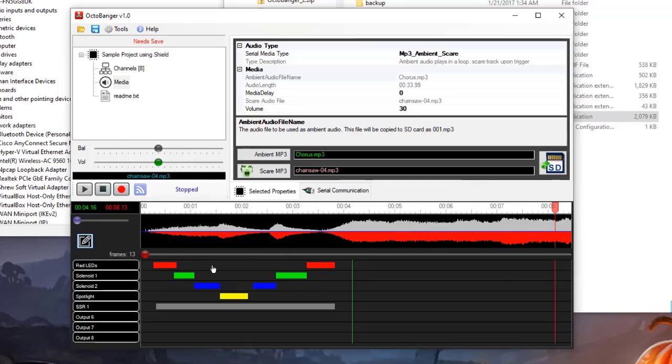And if I use the left button and drag it, I get an on switch in the sequence anywhere that I drag it. So that's very easy to do. And if I screw it up, I use the right button and it's an eraser. Could not be easier. So if I wanted to just cut those all in half, and then plug in my Arduino, send the sequence to it, power it up, I would then see the new sequence. So let's say I wanted the sequence to go all the way out to here. And then I set my new end there.